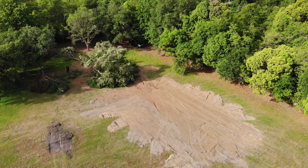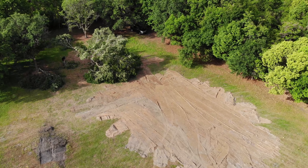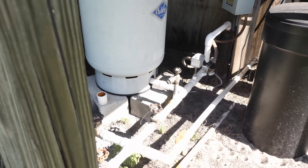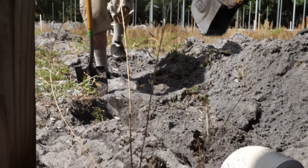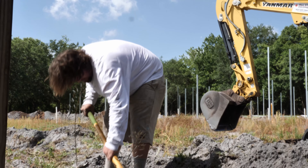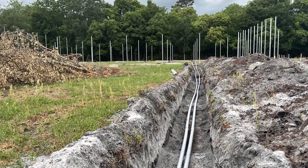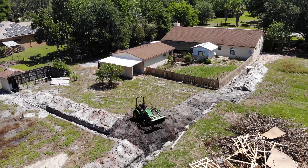Next, let's talk about power and water. On the property we have an agricultural rated well already because of the garden and front landscaping. So we were able to tie into that existing well that feeds both the house and the landscaping irrigation, and we ran a two-inch water line all the way into the footprint of the greenhouse. The water was fairly simple other than the gluing and the trenching.